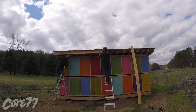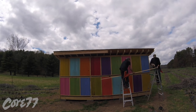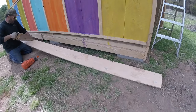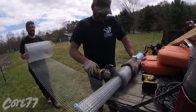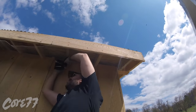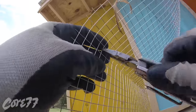This is actually the fifth day of work, but the first and last days were only just a couple of hours. We're just putting in the fascia boards. Considering it's all open under the rafters, we had to put some wire mesh up there to keep the birds out — there's a big concern that birds will nest in here. The primary reason for this structure is so that bears and predators can't get at the bees, because there's going to be a lot of honey in there. So this is sort of like a bee safe. We're cutting the wire that's going to keep the birds out of the soffits, and I was happy to cut that with the grinder. Me and Dave — two-man staple team. You can see how I break that wire with my Leatherman; I just twist them until they snap.